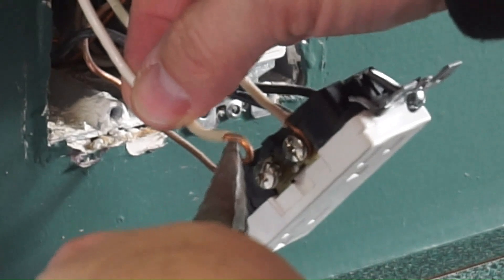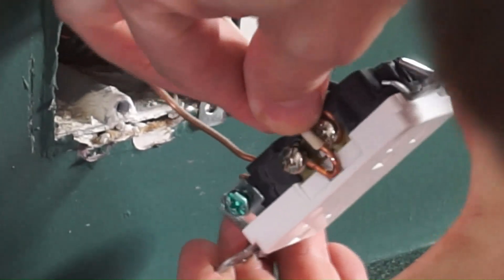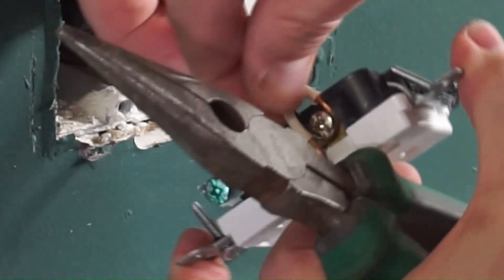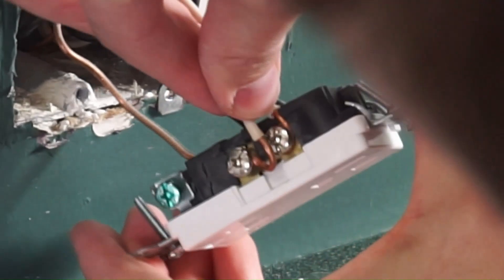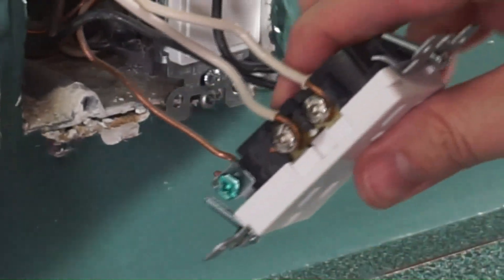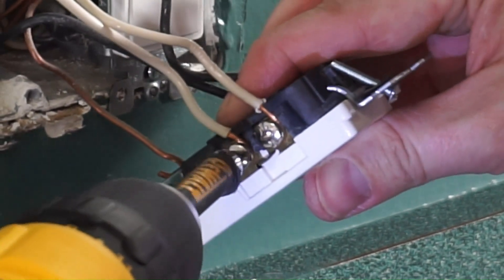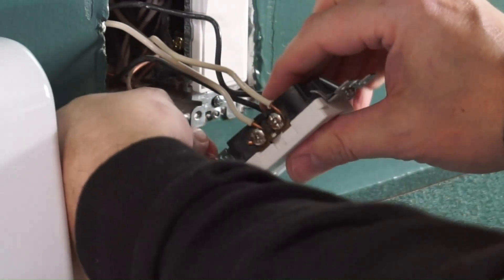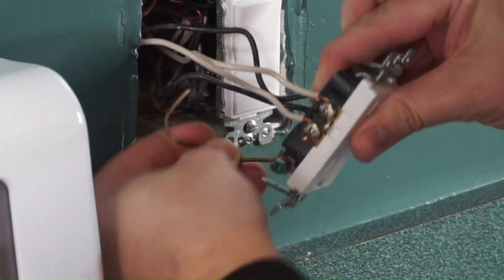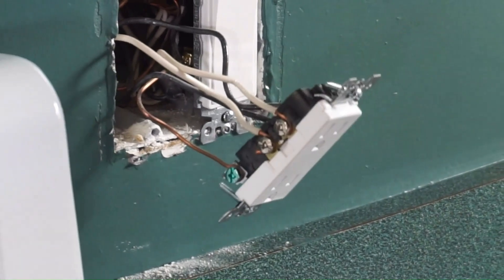Now this one here, we have to open up the curl — I can tell it's a little too tight, and it looks like it's at a bit of an angle. That looks perfect — absolutely perfect. Now all we've got left is our ground wire. We've got our hots and our neutrals connected. Tighten down the ground so we're code.